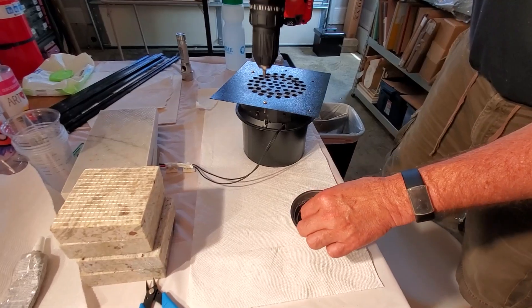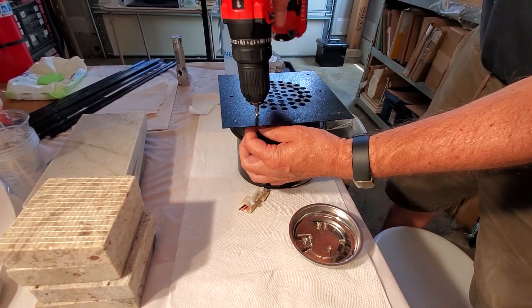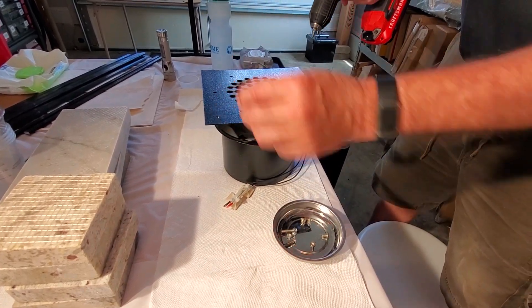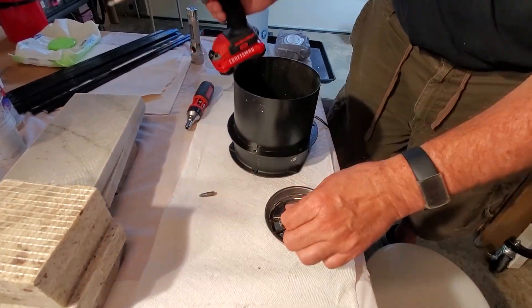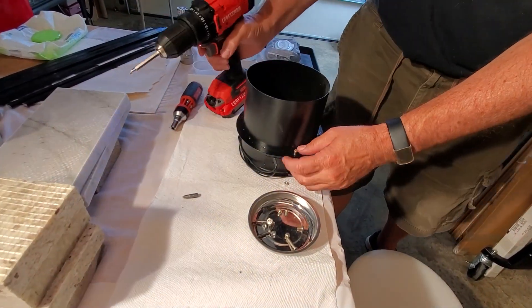This is how that was wired in, and I just went ahead and cut these wires because I don't intend to put this fan back in at any time. Now it's easy to remove the bolts holding this grate to the front of the fan — it keeps things from blowing through your exhaust system. Then you turn it over and remove the flange, because you're going to need the flange and the grate when you put it back together.